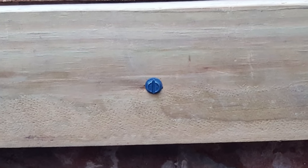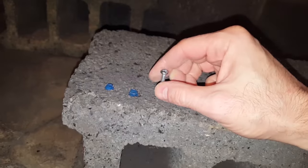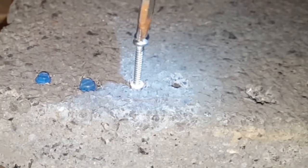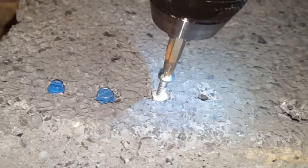Once it's tight, do not over-tighten. If you over-tighten it, you could strip the hole and it will be useless. If you do strip the hole, you can try to use a plastic anchor — in this case a 3/16th hole, since I used a 3/16th bit for the quarter-inch Tapcons — and then use a regular screw through that plastic anchor. But you don't want to strip the hole.